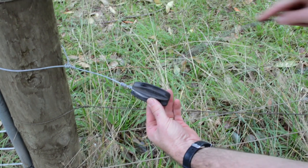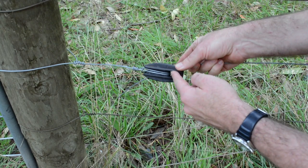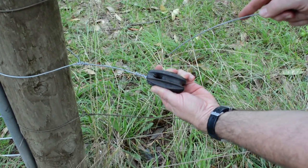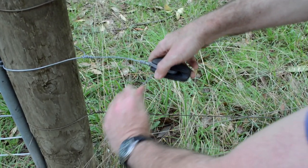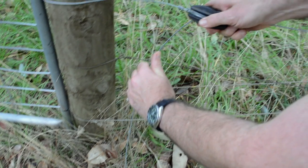Now we're going to add our electric fence wire, which is insulated from our post. You'll notice that I went to the end hole coming from the post — this time I'm going to spin the insulator 90 degrees and you'll see there's a new channel opening up with a hole furthest away from the electric fence. I'm going to put my electric fence wire through that, giving myself a generous portion because I'll be using a fair bit of it.